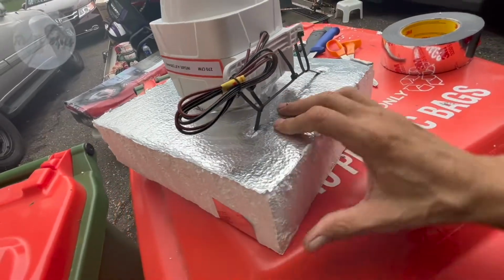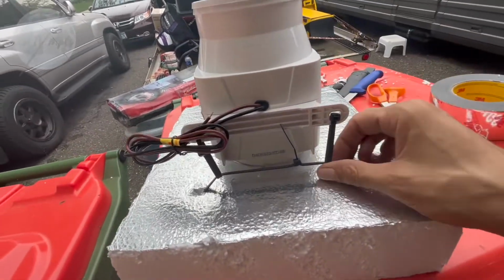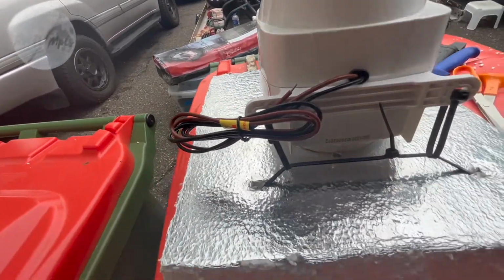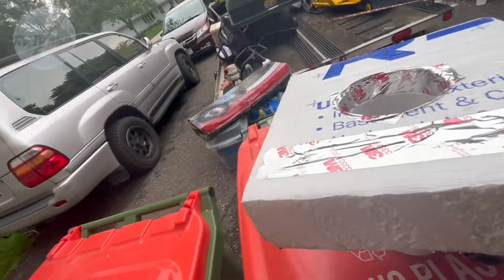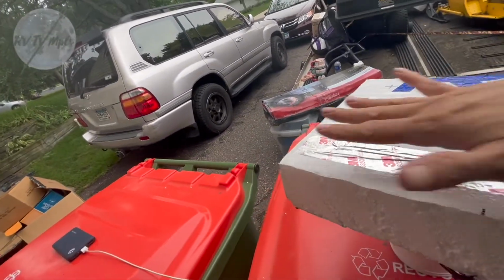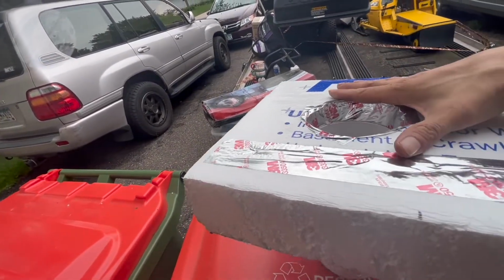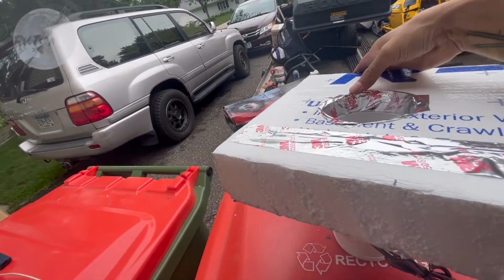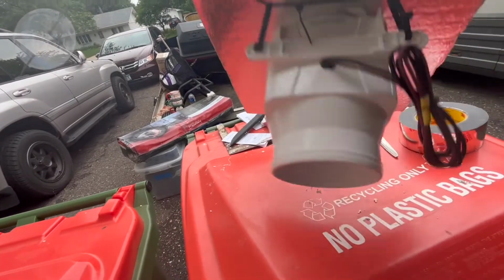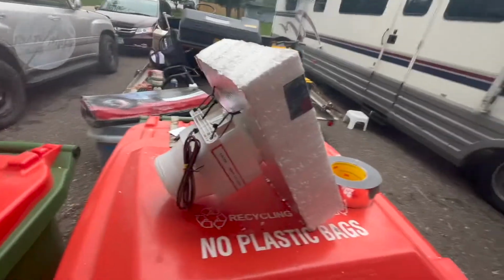Here is the top piece that's going to be going back into the coach. Here is the bilge fan. You can see that my love of zip ties continues. So basically I just zip tied it right here. And I ran that through. And then just secured all this back down with tape. And then I'm going to glue over all of this, put that up, screw it in. Also I'm going to put some weather stripping down before I go any further. I'm going to scrape all the old stuff off. Weather strip that up, get this mounted into place, and then wire this bilge fan in and see how that works. Step 1 of 20 done.